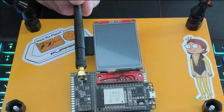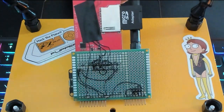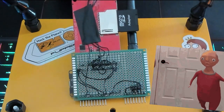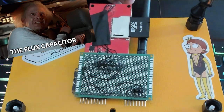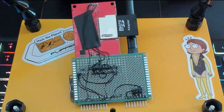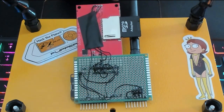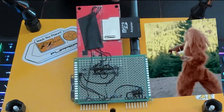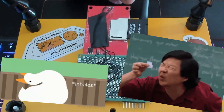I know it's super ugly, but if it works, it works. Now for this guy — the Mark II has a little bit less sturdiness and a little bit less hot glue, which some people seem to think is a lot more desirable. The wiring is still pretty ugly, but the soldering is a lot better. There's not as much burn on this one. I burned that crap out of the other board, so I got flux, got a better soldering iron, upgraded the whole setup, and the results look a lot better. The one bummer is this SD card is huge. I literally might rip the entire SD card slot off and install a micro SD slot. If I do a Mark III Yeti Board — which I definitely will — it's going to have two ESP32s on it and a micro SD, not a full-size ugly honking SD.